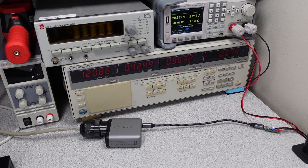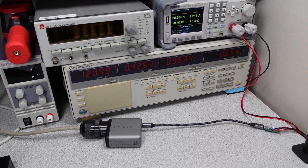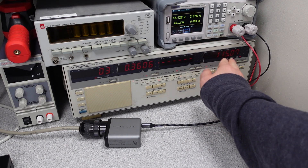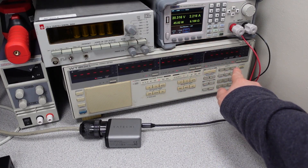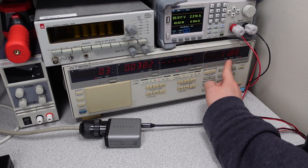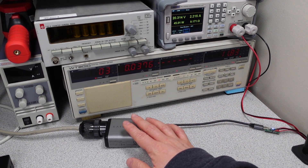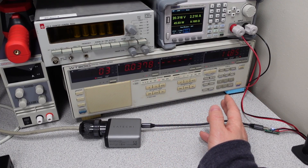If you had a lot of these power devices all plugged in at once, the peak current is going to get unruly very fast, so having power factor correction keeps that number nice and low. Looking at the THD: at 45 watts in 15-volt mode, THD is about 115%. Switching to 20-volt mode — still 45 watts — it drops to 12%. That's a huge decrease in THD, a much cleaner signal. The only thing we changed is going up to the 20-volt mode. So this device seems pretty exclusive in delivering power-factor-corrected operation only in that 20-volt mode.